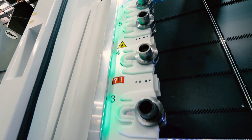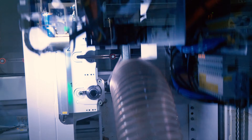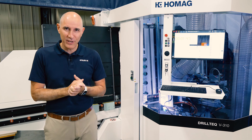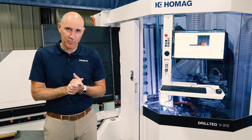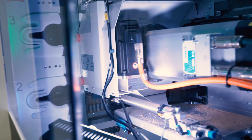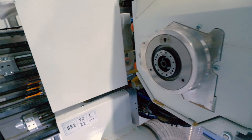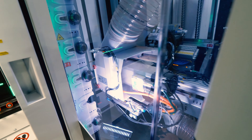The integrated eight-tool automatic tool changer also uses intelligent guidance for ease of operator setup, tied directly to our onboard tool management database. The independent access split head drilling technology allows for program optimization for both vertical and horizontal drilling. The high-performance router spindle incorporates an interpolating C axis for use with a broad range of aggregate units.